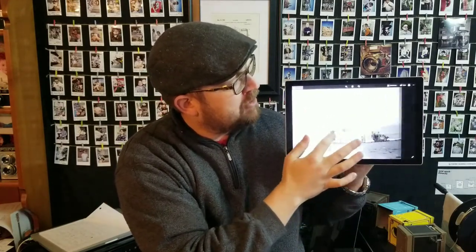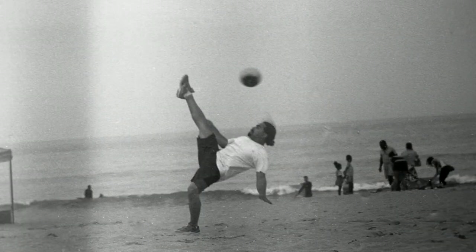Here's an image that's out of place. I'm metering all this stuff — I saw a guy down at the beach. This is when I knew that my shutter had kind of broken; at least it stayed in the open position. I saw a guy kicking something on the beach. You can actually see some dark banding right here. This was a little bit closer to nighttime — getting quite a bit darker. We can see a little bit of that movement, which is another reason I figure we're about 1/200th of a second. The ball's moving very fast. The rotary shutter has kind of an arc to it — you can see that curvature right there. I just think this is an interesting photo that helps me diagnose some problems.